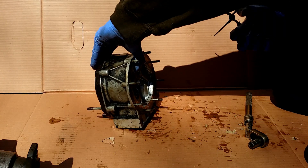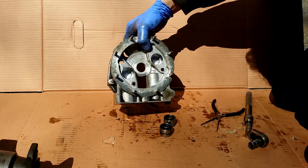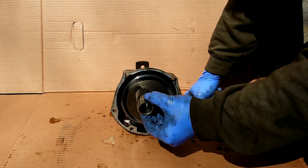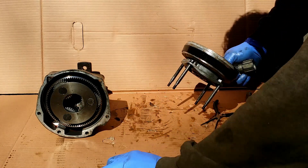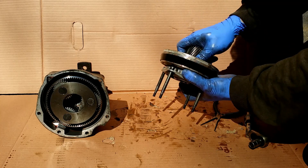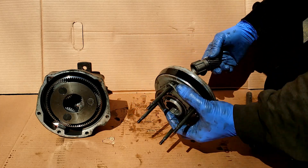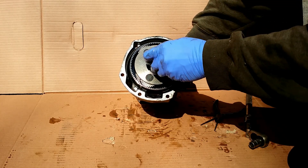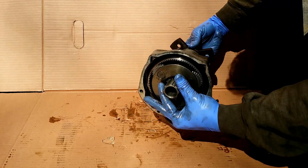We pull out the pistons. Now the mechanical part with gears. Here we have a sun gear that is sitting on the shaft but is in no way meshed with it — it spins freely on the shaft. The sun gear is locked with the sliding clutch so that the clutch and the gear turn together at the same RPM, and the sliding clutch can slide back and forth on the sun gear. So when the sun gear turns, the sliding clutch turns with it. The sun gear meshes with those three planetary gears. The planetary gears mesh with a ring gear, and this one turns the flange that runs the driveshaft in the car.